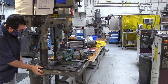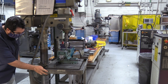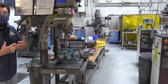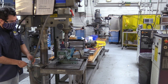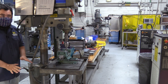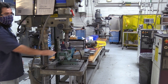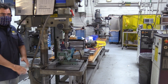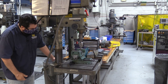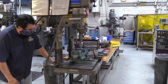Be aware of backlash — it's basically the space between the gears. When raising, I'm putting force on the gears going up so it won't slip down. But if I'm going down and there's space and I put force there, it can push down into that space and I lose accuracy. Always stop moving the table in the up direction. Then lock it back in place.